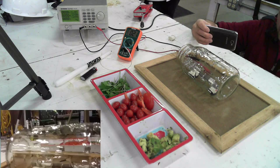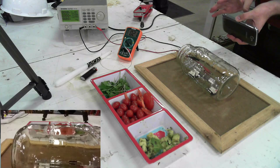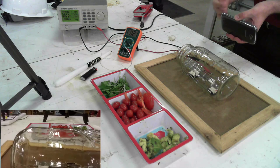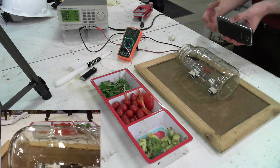So if you recall from our test previously with lithium aluminium hydride, where we were able to see the pressure, from about 120 to 190 degrees, most of the decomposition occurs. And so that is when the highest pressure should be in the cell.